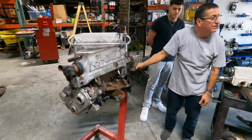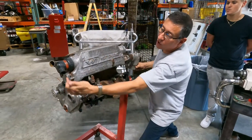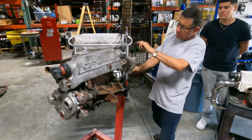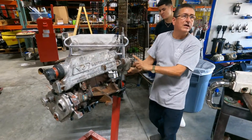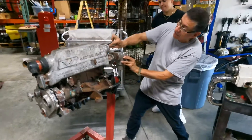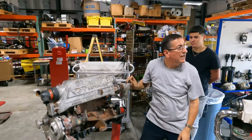I have gases here and this is the exhaust pipe. Here I have the heat exchanger. Raw water enters here, goes out, and enters the exhaust manifold. If this point is below the water line, I need this hose to go up and over here to avoid that situation.